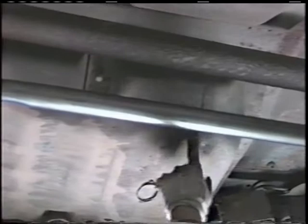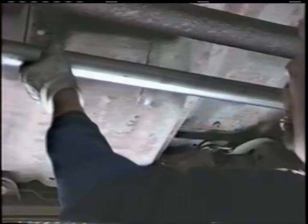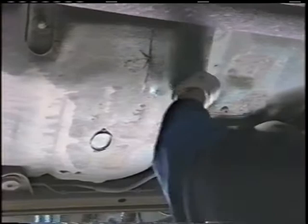Walk back underneath the car. We're going to put that pipe right into the catalytic converter extension. I've already made a mark on the floor. I know that this is rounded here. It starts to flatten out and go up, and that's where I want to make my bend to go up and over. So I'll just physically make a mark on that with my finger. We'll walk over to the bender. We'll put our last two bends in, which have to angle up and outward to meet into the muffler and be level.